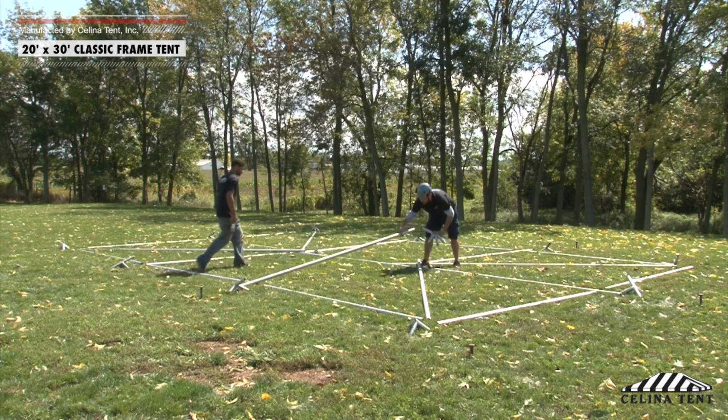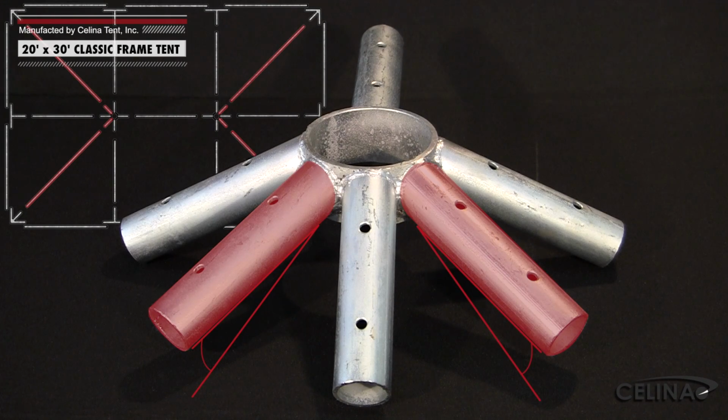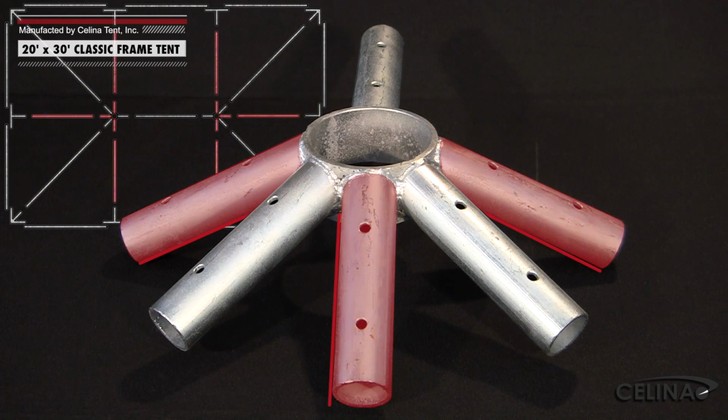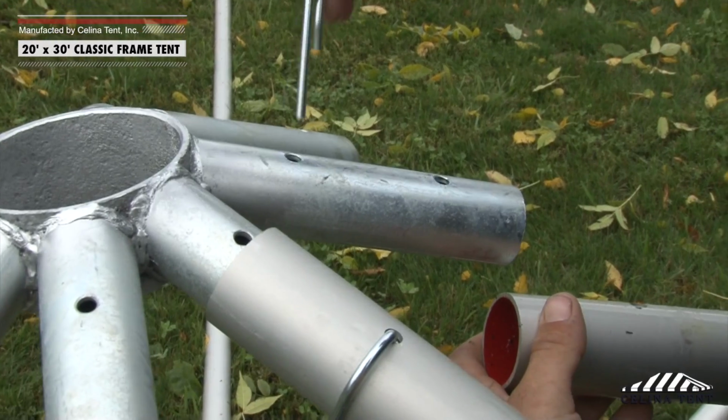Step 2. Begin with one of the 6-way crowns. Lay the crown on a flat surface to determine the correct placement. When the crown is on a flat surface, the angles that are not touching the ground will correlate with the two corners. We will call these angles A. The angles that are touching the ground will correlate with the 3 side tees. We will call these angles B. The last protrusion, which is horizontal, will correlate with the other 6-way crown. We will call this angle C.